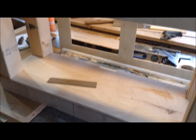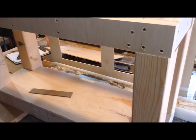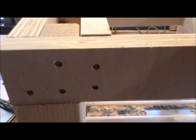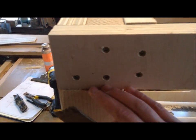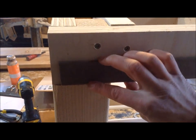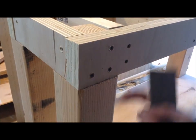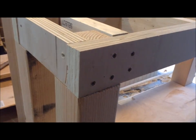Now that this is pretty much back together, I was able to just pop those side panels off and put them back on. The only difference is that the laminated plywood is a little bit thinner than those original 2x4s, so I have a slight lip. I'll add just a couple strips along the edges so I have an even plane to attach the surface. If you're starting from scratch with this plywood, just don't cut your laps as thick as I did and you won't need this extra step.